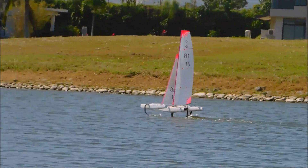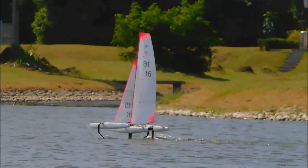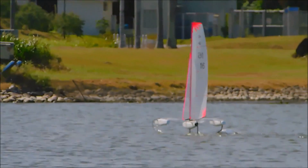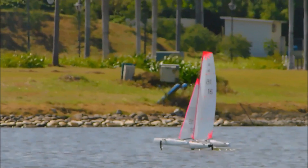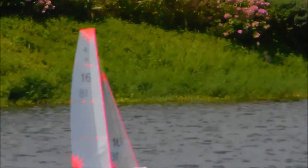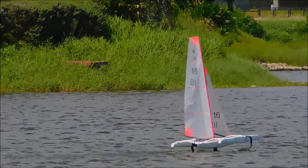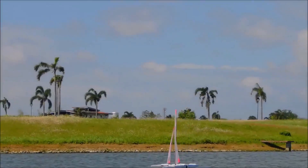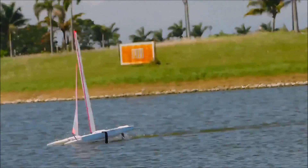I am pleased to be able to say that the boat has not yet shown signs of pitch polling, even during one of these crash landings, which is most encouraging. The small foils need careful trimming to reduce the angle of attack right down to the minimum required to get lift — any extra lift causes ventilation to occur. I have now found that once the boat is up on its foils, I need to reduce the attack of the rudder T-foil and give the boat a nose-down attitude, thus reducing the lift from the foils.